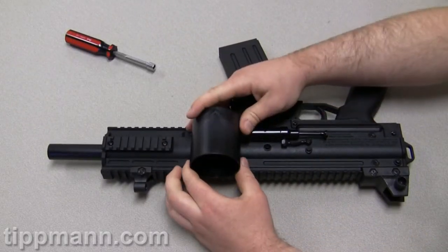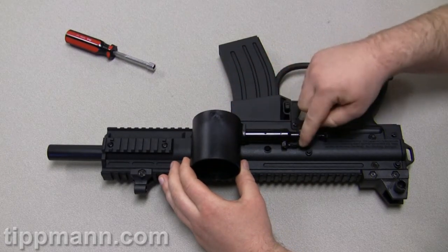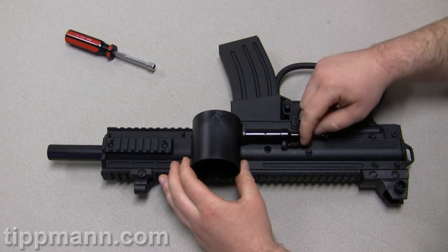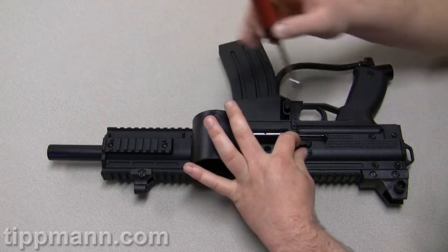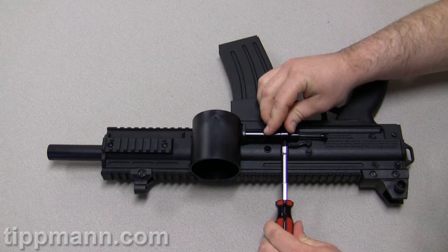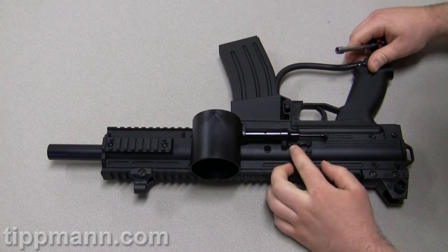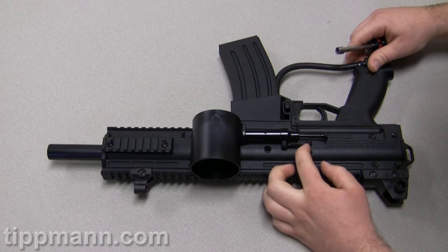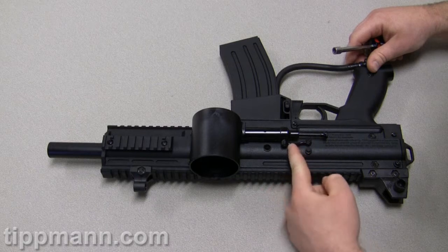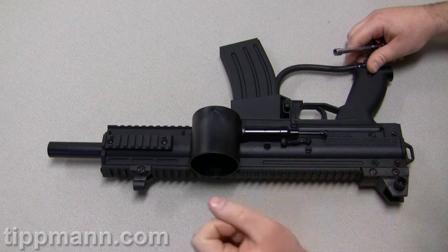Now we have the X7 Cyclone feeder. I usually just do a visual inspection to make sure that my hoses and my fittings are nice and tight. You want to make sure that the fittings are nice and snug. If not, you'll have a leak, and that may cause your Cyclone feeder to malfunction. Also check to make sure that your hose is nice and tight on the barbed fitting, and that it doesn't have any holes or isn't frayed on the end. It'll get frayed on the end from excessive pulling it on and off.